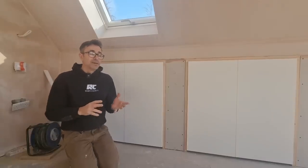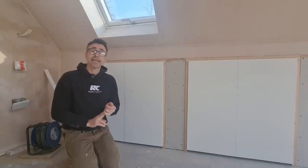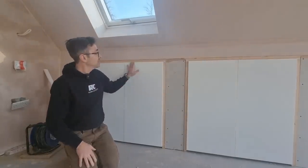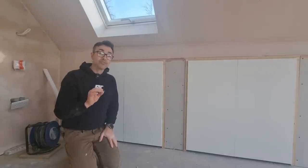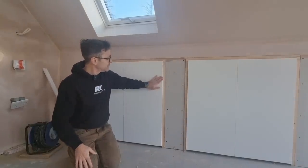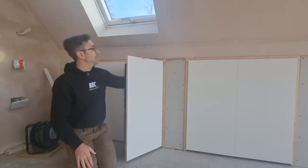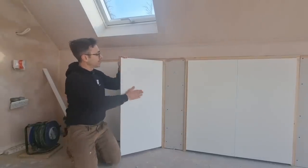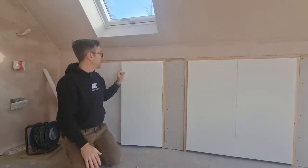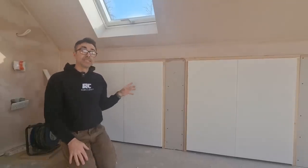The reason I don't buy the material, pick it up or have it delivered, bring it on site, and cut it up is twofold. First, it takes a lot of time and labour and it's quite messy. Second, the quality produced in the factory is far better. For example, I get them all pre-primed, and all the MDF has a preparation tape on it, which means the edge and the face are exactly the same when painted — no furring up, no prep for the painter.